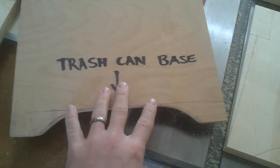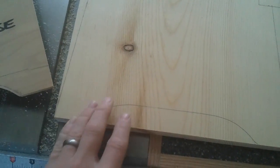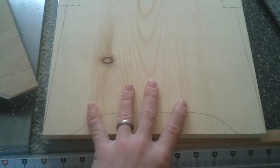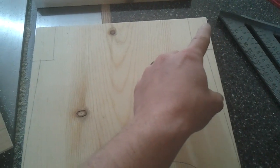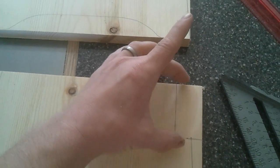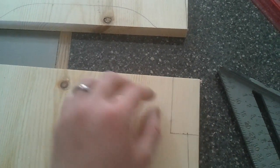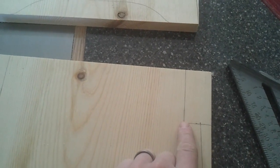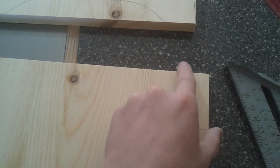I've got both of my legs marked out. I've got this little template I like to use for the bottom of trash cans — I've just outlined that on here for the bottom. I'm going to trim out most of this with a jigsaw and then clamp the pattern up here and route the rest of it nice and clean. This is all out of one-by-twelve, so if I was to just bring this up to the top it's going to be all in line, and I don't want that — I want a half-inch overhang for the top on all sides. I'm going to make this cut on the table saw to cut out this corner.